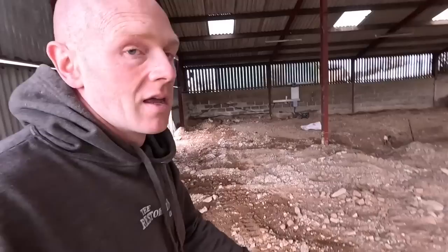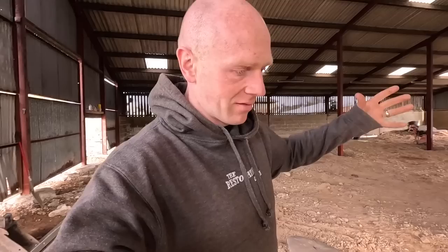We're not far off. We've worked out already that we're within sort of 50, 60 mil in most places. There's obviously some dips, but at that point, then we can get that fairly smooth before all the drainage starts being trenched in. I've seen the draft drawings, so now we're just confirming those, and then it'll be a bit more precision work because we need to get all those depths right. But it's all good progress.